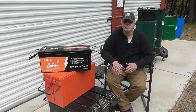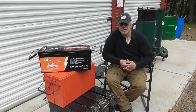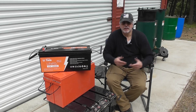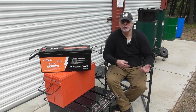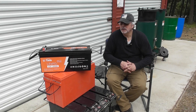The backup battery bank uses 200 amp AGM batteries — I put in eight of them for a total of 400 amps. But I've had one of those fail, and your battery bank is only as good as your weakest battery. Rather than put in a new battery and deal with mixing new and old batteries, I decided it's a pretty good time to upgrade that backup battery bank. I did a bunch of research and came up with LiFePO4 batteries.